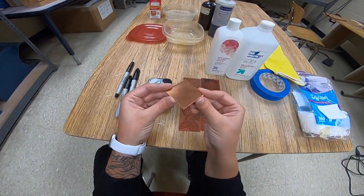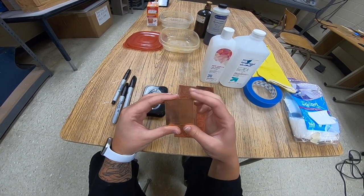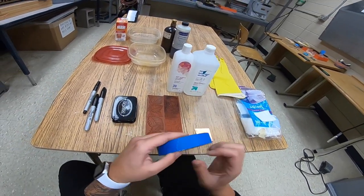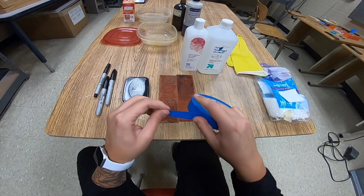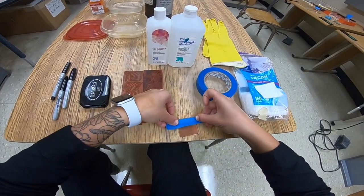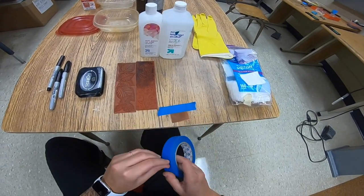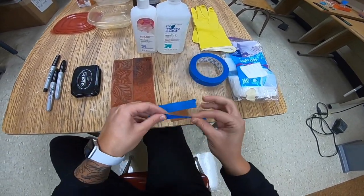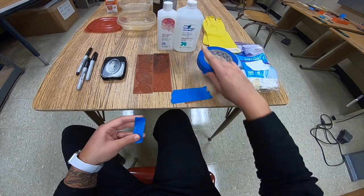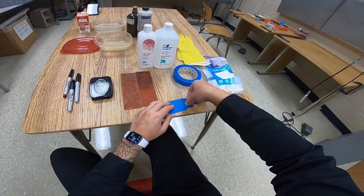The first thing you need to do is cut your metal to the size that you want. You'll notice it has a lot of scratches and dirt on it. So we need to prep our metal, make sure it is clean, and tape off the side that we do not want our design on. The tape is going to protect that side from the acid. I'm taking a few pieces of tape and layering them, pressing them down on the back side of my metal. You want everything to be covered to protect that side.